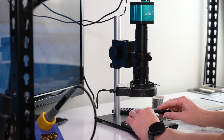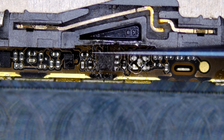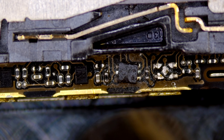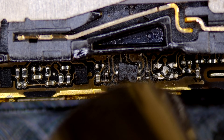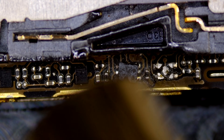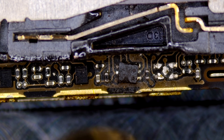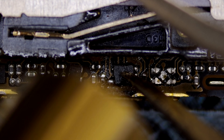It's fair to say I spent a good amount of time trying to find components that had blown off the end of my tweezers. Thankfully, they never got too far away and I was able to retrieve them. With the chip in place, it's time to get it soldered down, which is easier said than done. I'd estimate it took me about 30 to 40 minutes. I had my hot air station set at 380 degrees, which was enough to slightly melt the back of the SIM reader, but not enough to cause any functional damage to it.